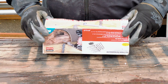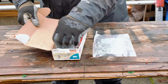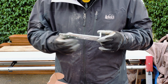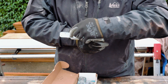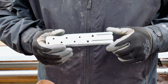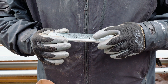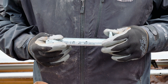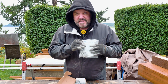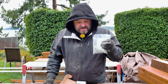Let's open up the box and see what's inside and take a look at the hardware. So these are the fasteners. Here's the bracket — this is the actual DTT1Z bracket. From what I've been told, these holes are mandatory. These two additional holes you add if you're in a high wind area — hurricane, Florida, East coast, Gulf coast type situations. But I usually fill them all anyway. If I've got the screws, I'll fill every hole. I have extra Simpson SD screws, and I also have longer ones and these short ones as well.